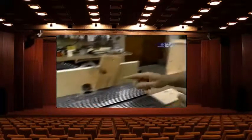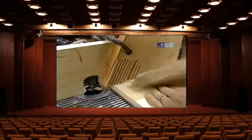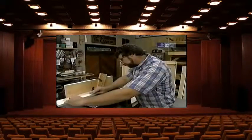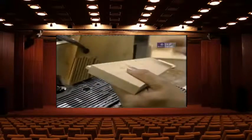That looks pretty good. The next operation is to put a groove on each edge of every other board, and I'll use my router table to do that. I've set it up with a quarter-inch slot cutter, a fence, and a feather board which holds the stock tightly down to the table — I'll end up with a groove about five-sixteenths of an inch deep on each edge. Then I've lowered the slot cutter so that by making two passes, I end up with a tongue which fits right in that groove.